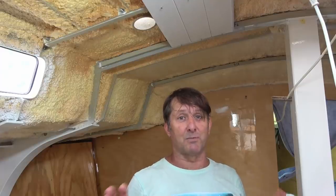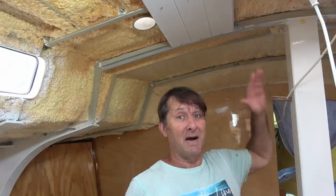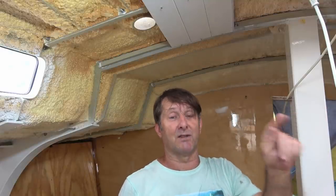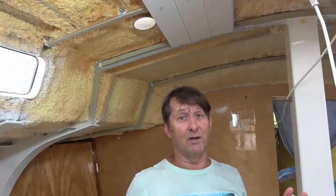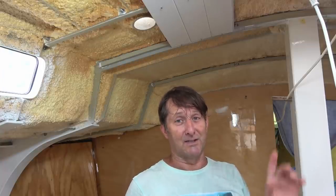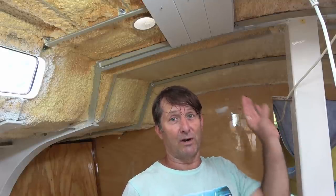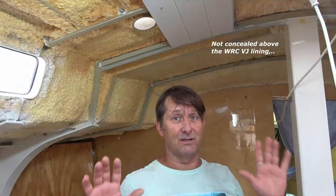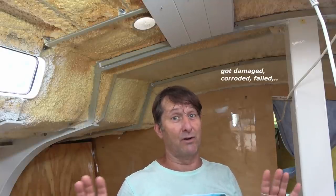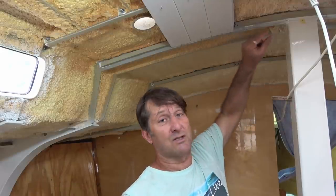And then the last thing to explain at this point in time is regarding the cables that will be coming down the mast that need to make their way back to that distribution panel. What I've decided to do with that is, when you look at sailing boats, one of the most problematical areas for running cable and power is upper mast to the top. And so I've decided I want to leave that cable externally in the event that A, I need to attend to some cable that might have corroded, or B, that I change things along the way. I'll just make a nice little box section.